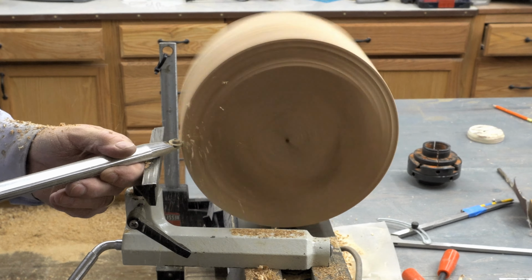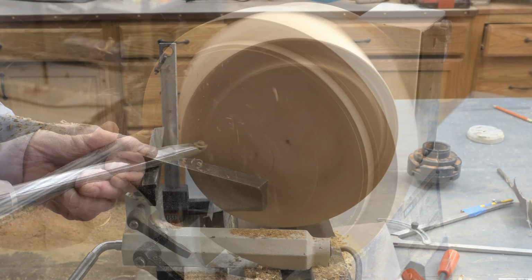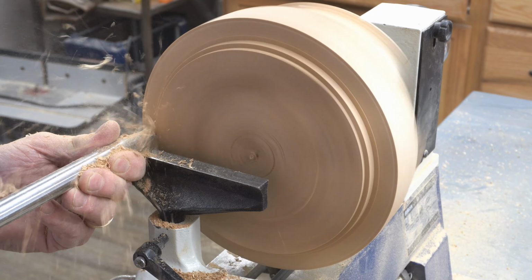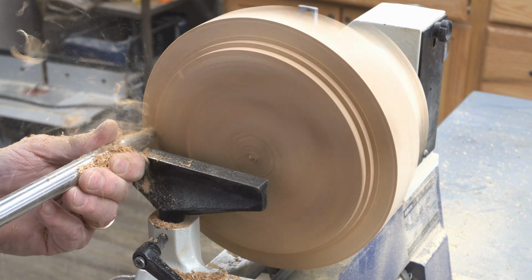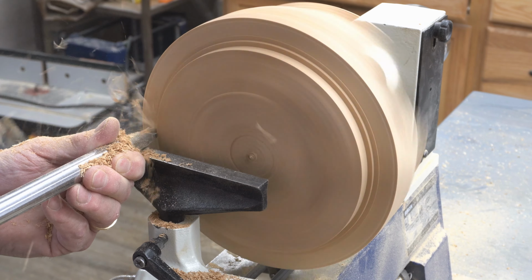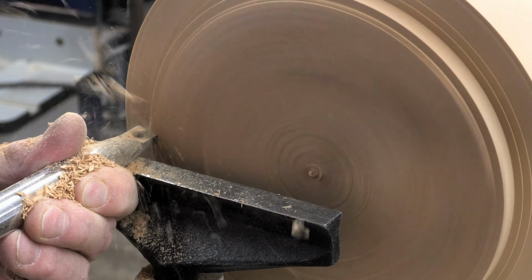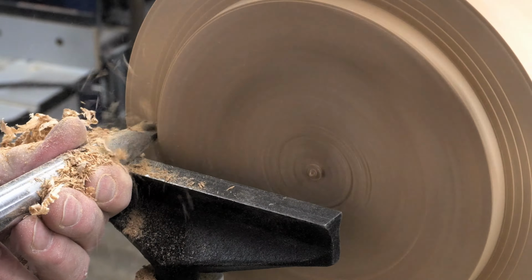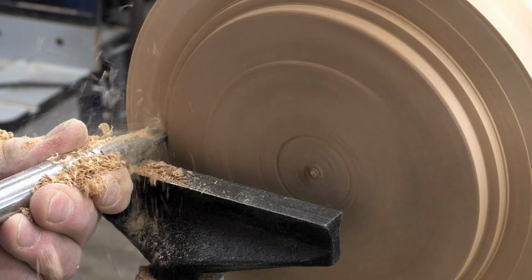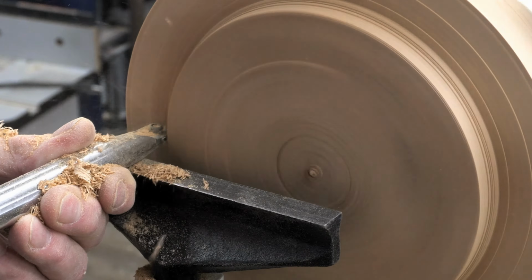The tree trunk wasn't very wide, so this split includes all the softer sapwood as well as the pith, or center core of the tree. The sapwood reacts differently to the cutting tools compared to the regular growth rings, and the center pith is prone to cracking when exposed. It would have been a better candidate for the lathe if it came from a much larger diameter tree and stayed away from those outer and inner growth layers.